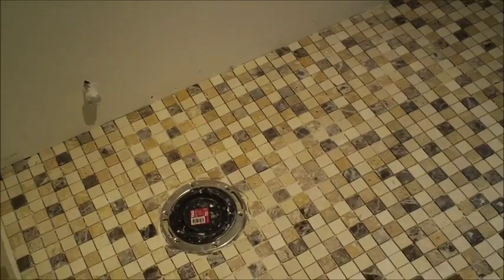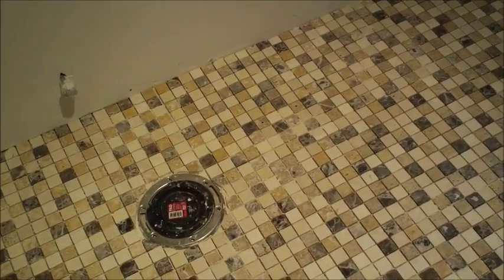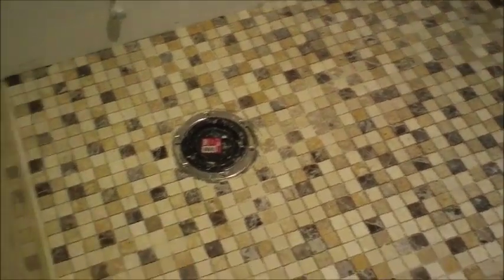So what I did this morning — last night I was up late listening to Monday Night Football, and I got most of the tiles cleaned off in the shower. You can see they've got a real nice shine on them there. I've got a little bit more work to do at the bottom, but it's not going to prevent us from grouting today because tomorrow I'd like to maybe seal it and set the toilet and all that. I left a perimeter around the side because I have everything sealed real well — I've already got a bead of caulk down there. I'm not going to worry about any further cracking; there's no risk down there.